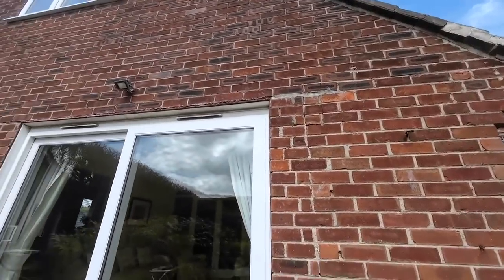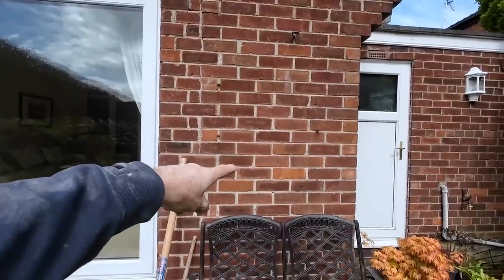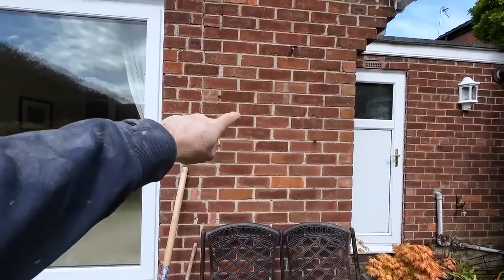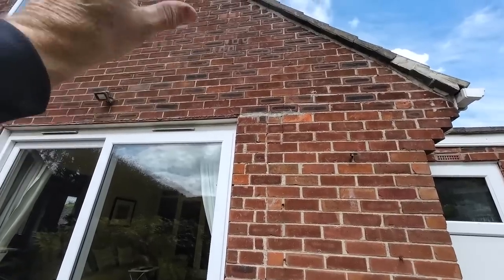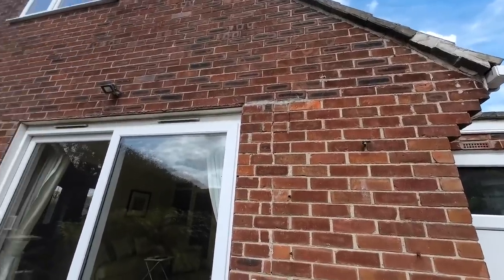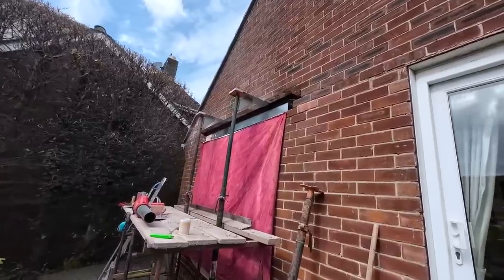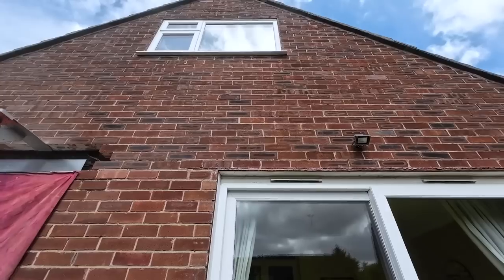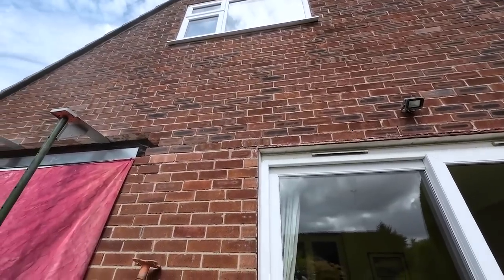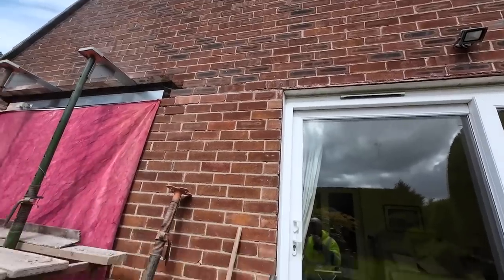So that's a lot bigger, that one. So we're going to be a lot early to start that one. It's weird because it's plainish brick with sand-lime mortar up to lintel height, then the bricks change and the mortar changes. That is rock hard, that. I found it really difficult doing this, and we've had five, I think, snap because the bricks are really poor quality. They told me the idea of having it rendered or pointed, and I think I'll advise them to get it rendered, because it's not nice.